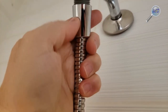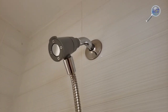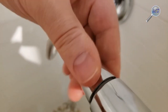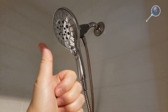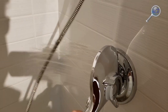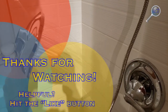Hand tighten the hose adapter to the base of the showerhead and you're all done. Before we say the installation is complete, we need to connect the other end of the kink-free hose into the showerhead wand — again, finger tight to avoid any leakage. With that, the installation of the Moen Magnetics Engage showerhead is complete. The only thing left to do is to turn on the water to check for any leaks at any of the connection points. Hopefully this video showed you just how easy it is to install a handheld showerhead in your bathroom. If you found it helpful, I'd appreciate if you hit the like button.